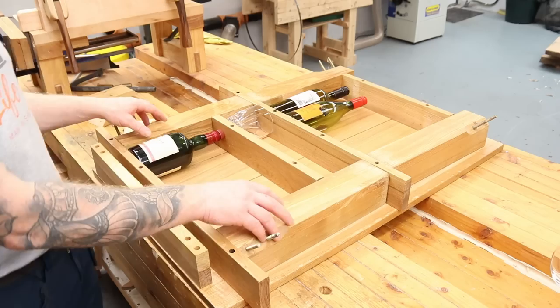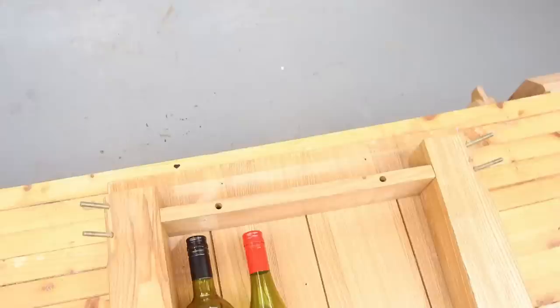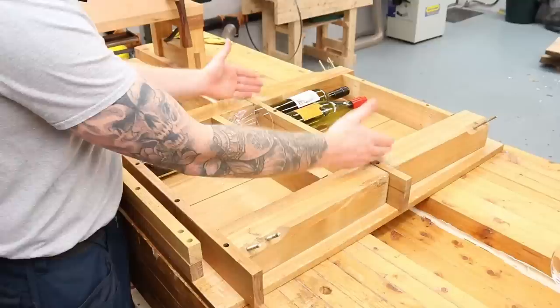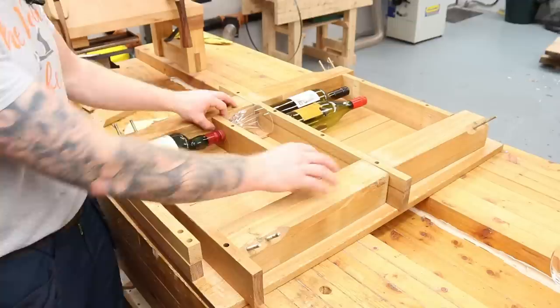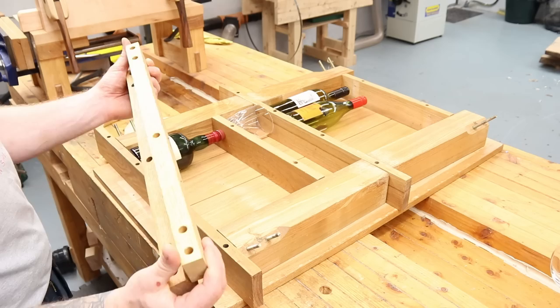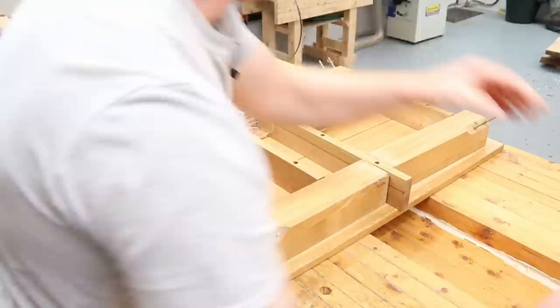We have the table upside down. We have our lines in it to look like oak planks. I'm going to take the legs and use them for pillars on the side, and our runners — our stretchers — are going to double up as shelves. Everything has screw holes so we might as well use them. The small stretchers will work as shelves between the legs, the long stretchers as the main shelves. I'll have tall bottles to the top, then the taller whiskey glasses below. The bottle of Redbreast just goes underneath. I also have room for a little shelf on top for more glasses, and I'm going to use the smaller stretchers to hang wine glasses from the bottom by cutting some notches in them.